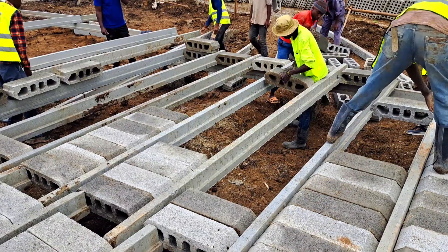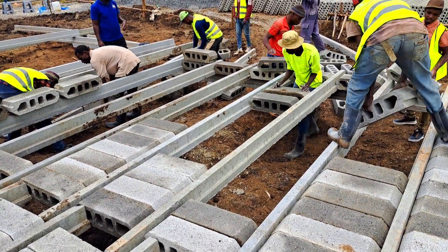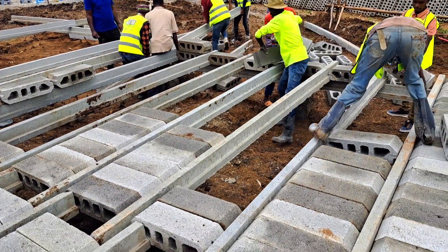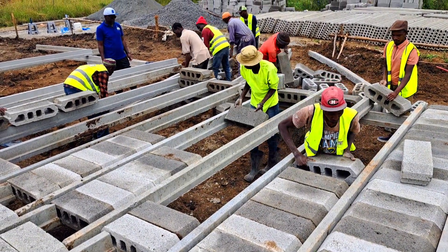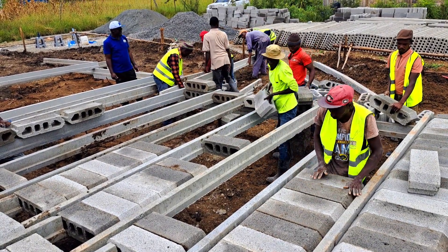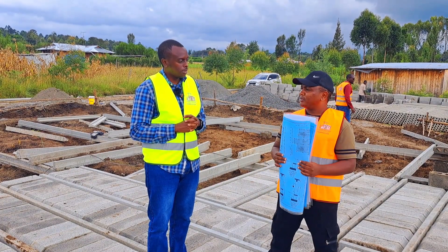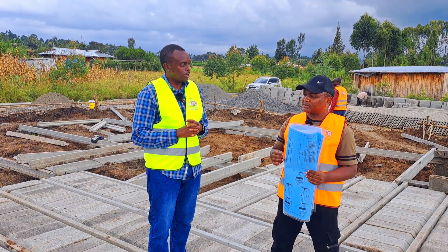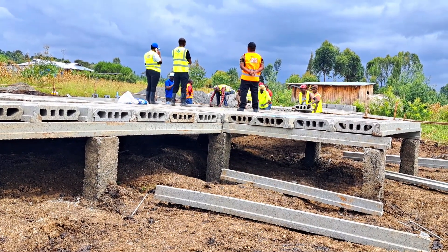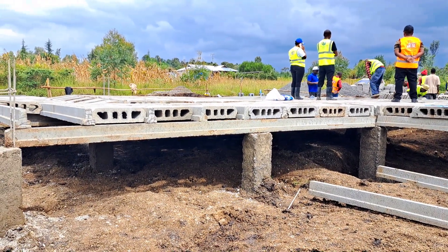You did the structural design for the slab. Yes. So for a client who has a similar issue — black cotton as their primary soil going very deep — you provide the assistance for the design of the slab using this suspended approach. First we do the site visit, then the trial pits. Once we see the depth of the cotton soil, we decide which kind of suspension, how many columns, what reinforcement to use, what spans column to column, what length for T-beams, and what layout direction for the T-beams and blocks.